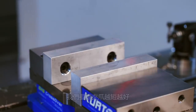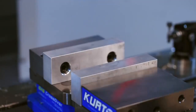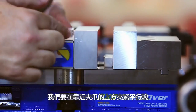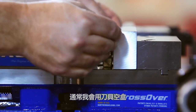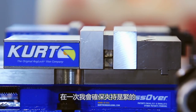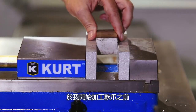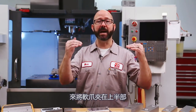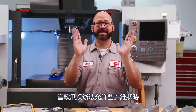We'll want to keep our jaws as short as possible to avoid deflection, and we need to make sure the vise is clamped tightly before we machine into the jaws. Clamping on stacked parallels can create the spacing that we need. For a taper-free part fit, we'll want to clamp our parallels as near to the top of the jaws as we can get without machining into them. I'll often use empty plastic end mill tubes to hold the parallels, and again, I make sure the vise is clamped tightly on the parallels, just like I tighten the real part.